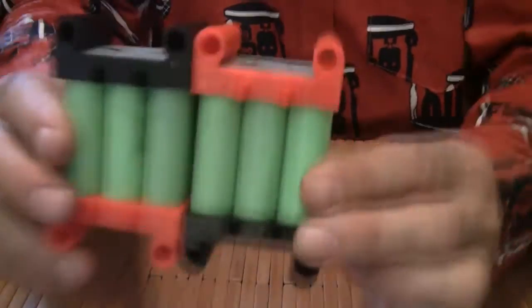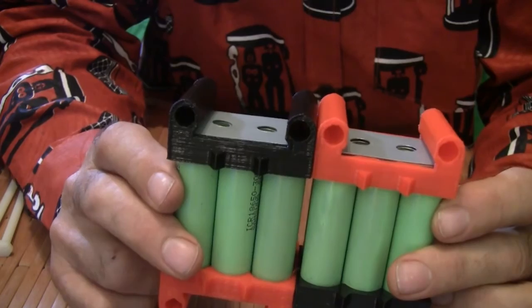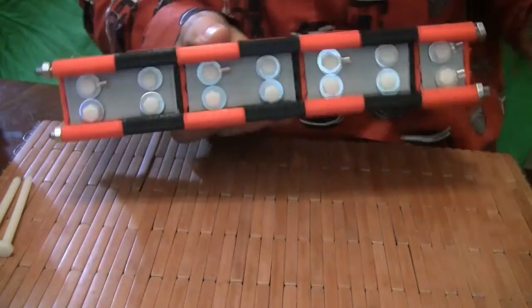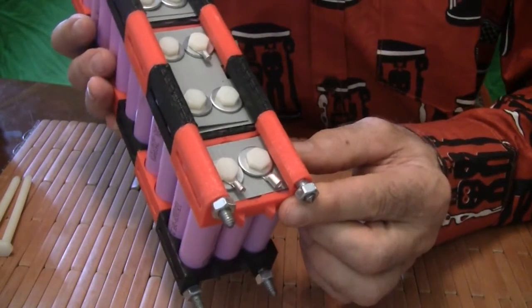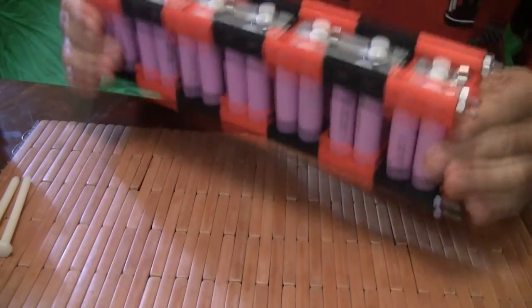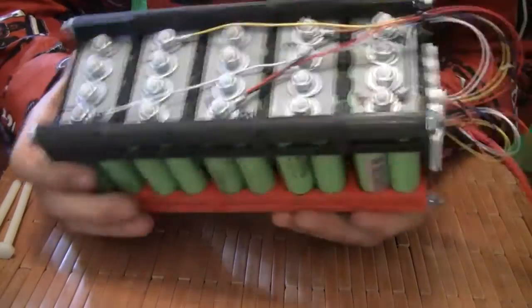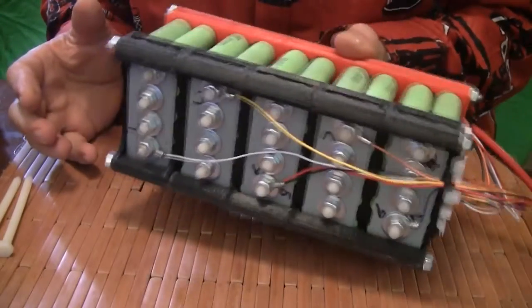Why does that matter? It matters because you see these holes right here? All these holes are designed to mount the battery cases to your project. For example, here's a battery pack that's been assembled. You can see that these are groups of six cells wired in series, and there's a piece of threaded rod that goes through all these holes up on top, comes out the other side, and these nuts tighten down. When they do, they lock the whole project together, making it very firm and rigid. Here's another example — this one's built with 10S battery packs, and you can see the rods that go through that lock everything together. This is a very, very solid, mechanically strong product.